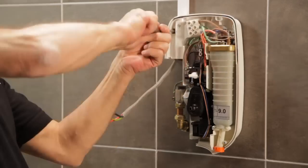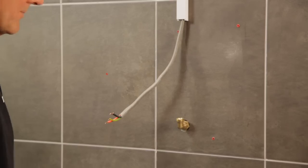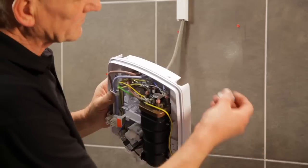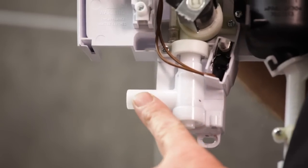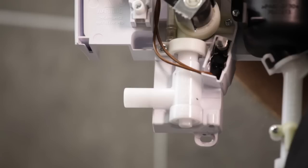Remove the wall fixing screws and remove the shower from the wall. Now for the T80Z Fast Fit. Take off the bottom trim plate and fit the top right pipe entry trim only. In this case, there is no need to cut out for the cable on the left as the trunking is in line with the pipe entry trim. Water connection is required on the left, so the swivel water inlet does not need to be adjusted.